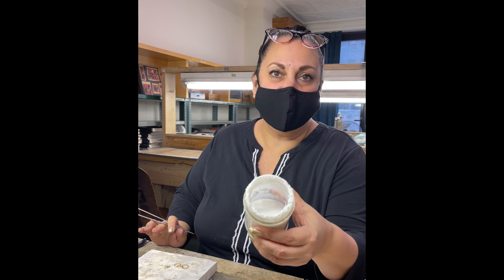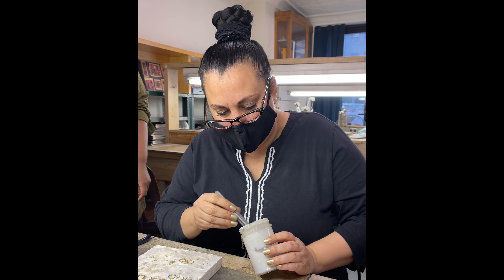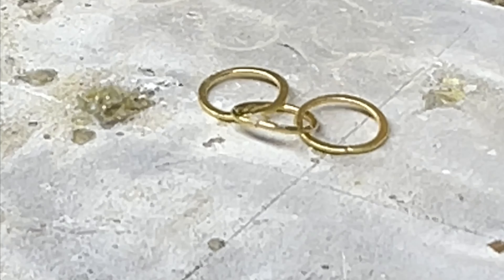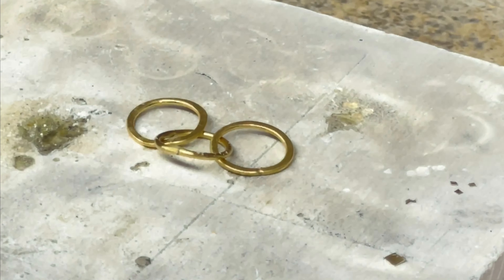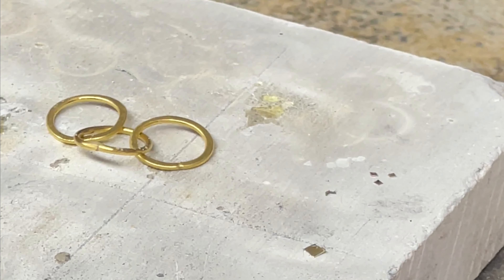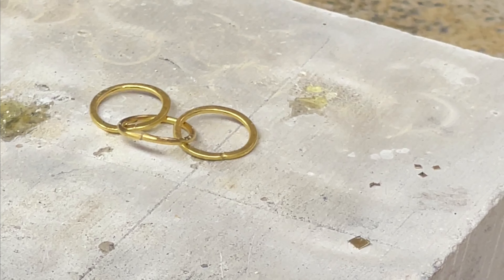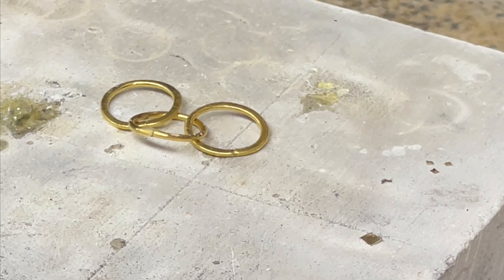You see now how the flux is nice and sloopy — it just makes things easier. I'm going to put a tiny little dab of flux there. You can dry it a little bit and stick your solder on there, or you can just start and your solder may jump off — because that's what those little things like to do — so just be prepared and always have your tweezers in your hand ready to deploy. There's a tip — that'll do.